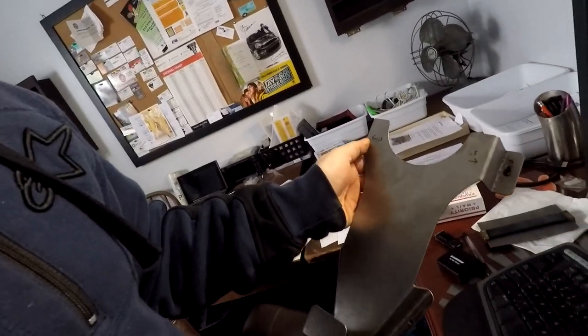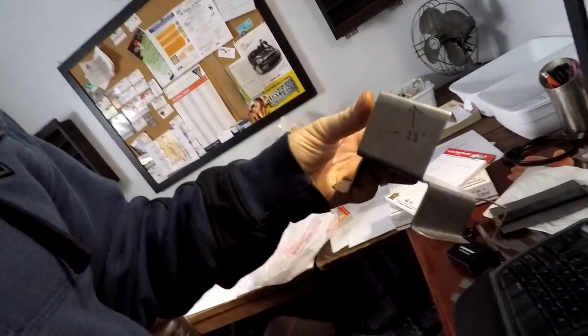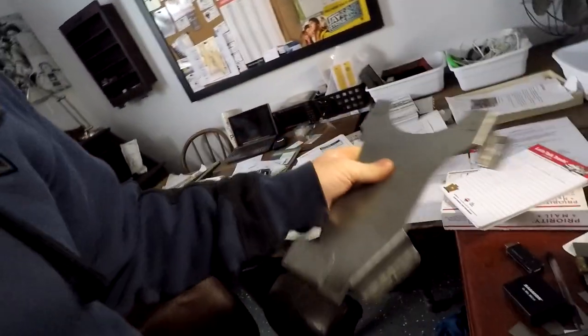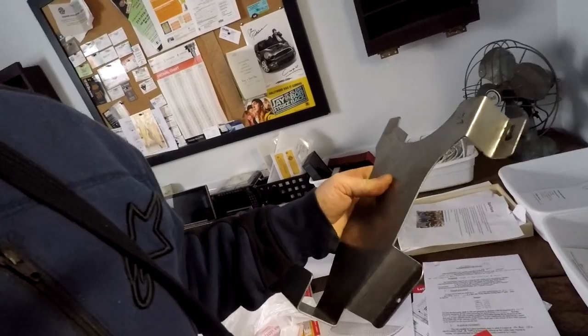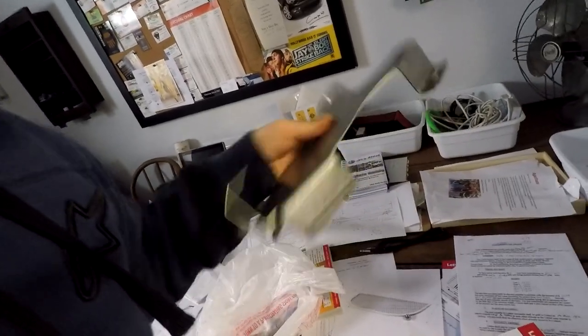We just needed to move these arms out a little bit, half an inch, which I did, and take a quarter inch off of this spacer piece and basically invert these bends so they're going in so you don't see them. Originally that's how I designed it, but I ended up bending them outwards only due to my press brake that I had, the dies get in there, but I rectified that situation. So I made a new drawing,